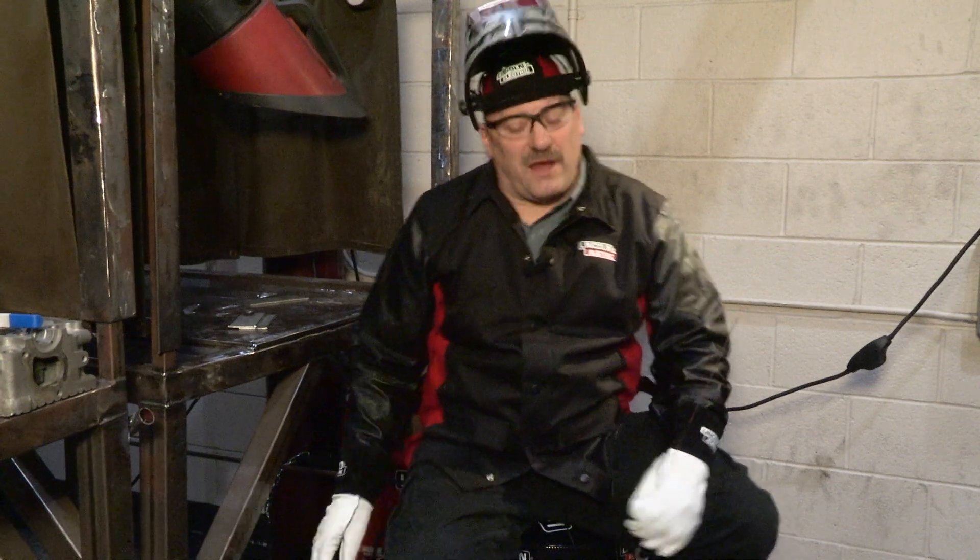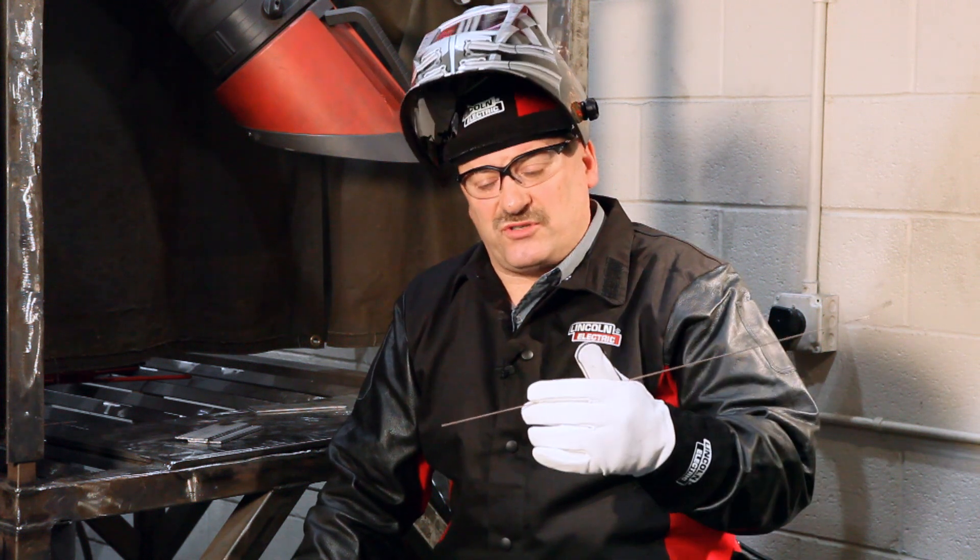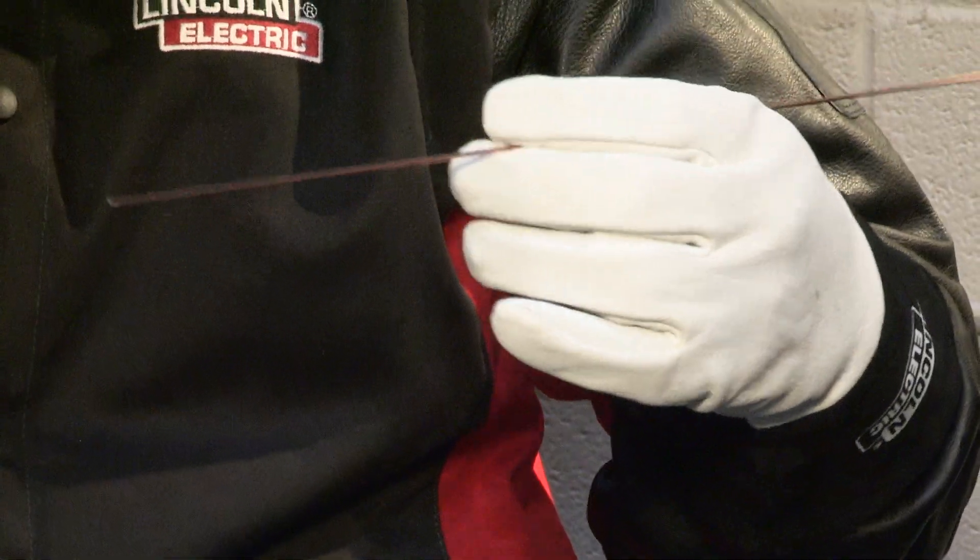I can run that at a higher current if I move faster, or at a lower current if I move slower. The thing about TIG welding is I control all the parameters. I control amperage with my foot pedal and I control voltage with arc length — the longer my arc length, the higher my voltage; the shorter my arc length, the lower the voltage. I control deposition rate by feeding ER70S2 filler wire into the puddle, and travel speed controls heat input: the faster I travel, the lower my heat input; the slower I travel, the higher my heat input.